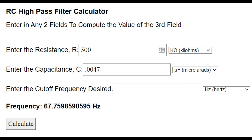So the value capacitors that we have chosen for this is in the 0.0015 microfarad up to, I believe it's 0.0047 microfarad. So these are smaller value capacitors than what you would have typically in a guitar for the tone control. You can see here in the screenshot of the calculator that I used, that I'll be putting a link to in the description, that I was able to kind of predict what frequencies would be rolled off using the resistance of the potentiometer in the guitar, and then inputting the value of the capacitors that I was going to buy, it would give me the output of what frequencies would be rolled off.